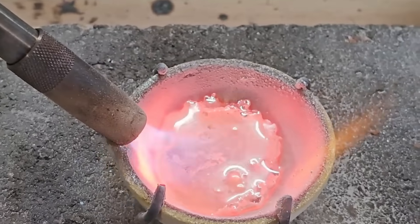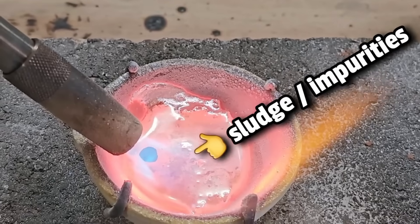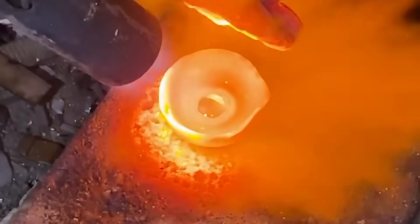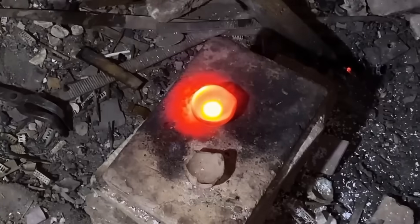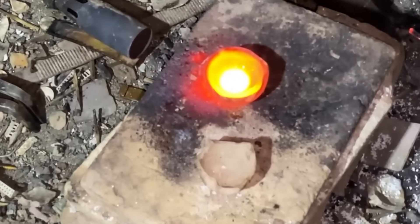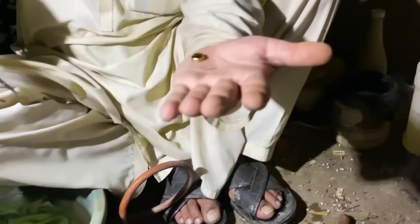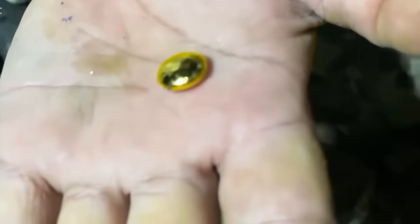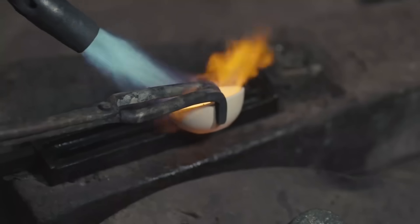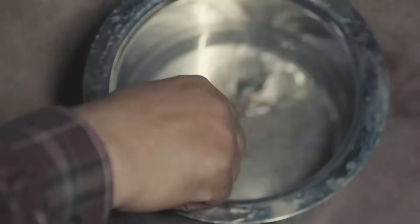As the rock liquefies, if you've done the process right, you'll start to see distinct separation lines — impurities rise, the gold concentrates, and it's time to pour. Using heavy-duty tongs, the crucible is lifted and with absolute precision, the glowing contents are poured into a mold. This stage is called casting. The molten material cools fast, within minutes, turning into a hard, rough metal cake. That bar isn't pure gold — it's what miners call a doré bar, a mixture of gold, silver, and other metals. Still, it's a proud moment: you've taken crushed rock and turned it into a visible, solid metal.